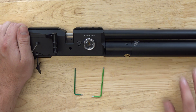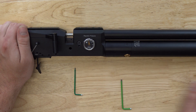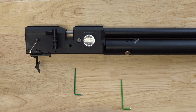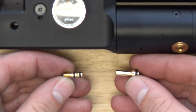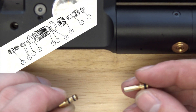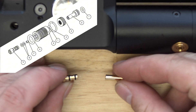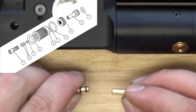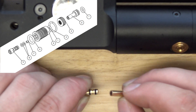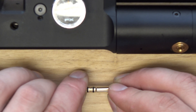This is the way it used to be written in the manual. The other way, which you can still find a lot on the internet, is that when you lower the pressure you just shoot a couple of times — you don't need to degas the rifle. I don't like doing that because of the way this regulator works. To visualize it: on the inside is the regulator adjustment screw and the regulator piston. The piston has a piece of delrin or sealing material, and on the bottom of the adjustment screw there's a small hole. When the regulator reaches the desired pressure, they touch and seal, and the plenum holds that desired pressure.